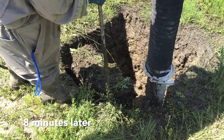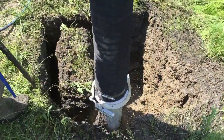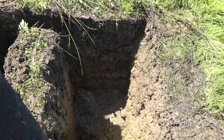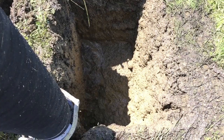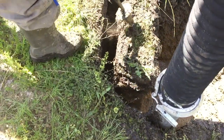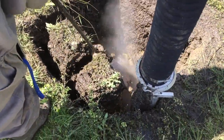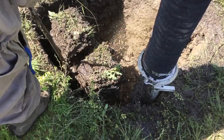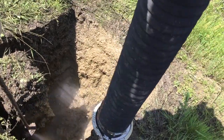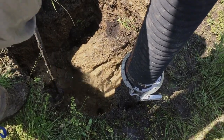As you can see, eight minutes later, the operator has opened up a rather large excavation. We have skipped ahead to this location so that you can see exactly the technique the operator is using to knock off large chunks of soil. He starts by digging a trench around a chunk of soil, then cutting it into more manageable pieces and knocking those pieces into the excavation for them to be sucked up by the powerful vacuum system.